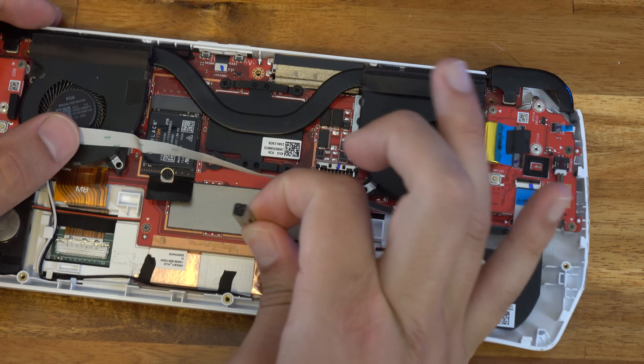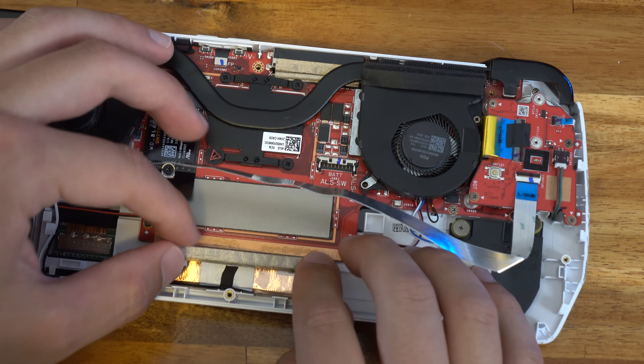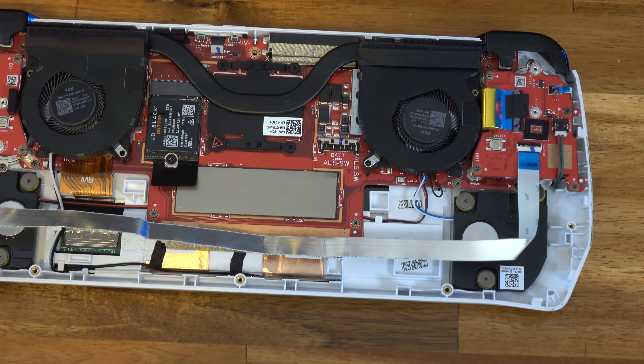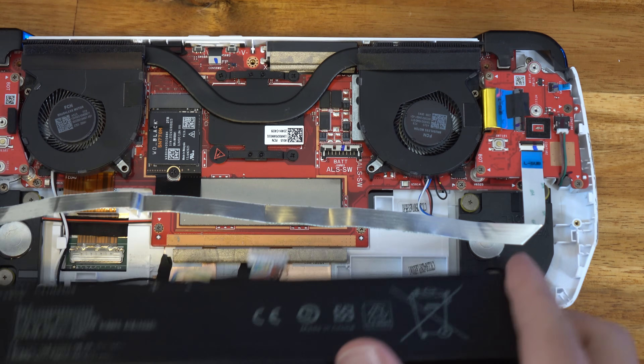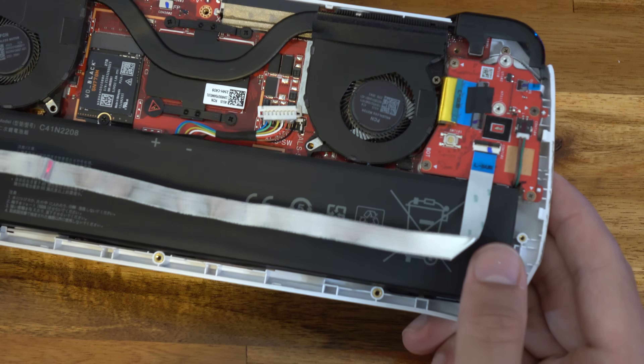We're going to take off this little pad that's covering this copper strip and just move it down about a centimeter. If you don't do this, it's going to get in the way of your battery and you won't have enough clearance to fit it inside the case. And then you can see here I'm just dry fitting the battery to make sure I trimmed enough away — not trying to force it in, just making sure I have enough clearance for it to fit in the intended spot. With that done, we're going to go ahead and move on to the back plate.